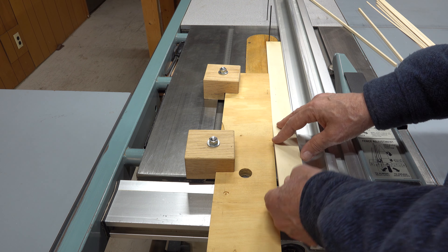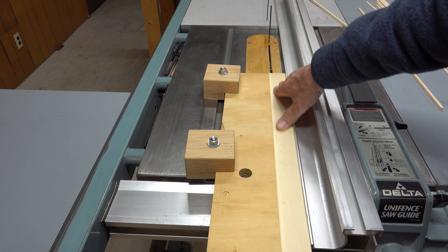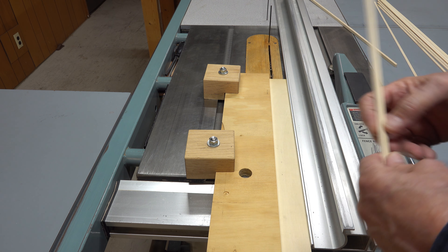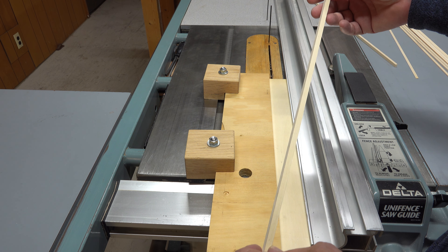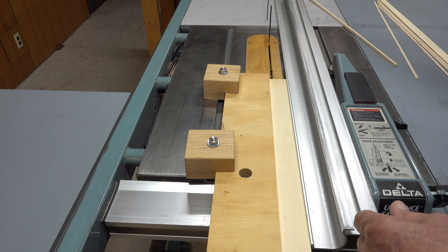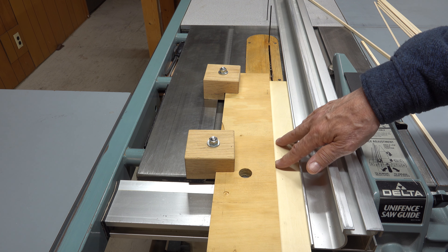Next time you move over, do the same thing. You're gonna want to have this fence so accurate each time that it's never tight — it's got to have room so things move in here freely and yet not have left-to-right slop. You'll have accuracy that always, if your fence is tight, is under five thousandths of an inch. I can do two to three thousandths pretty readily also, but sometimes to hold that two thousandths I'm gonna need my longer fence and a clamp on the other end. If you do a really good job setting this up, you'll find you can really tighten up your accuracy.